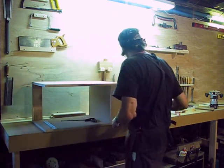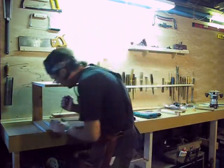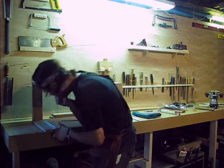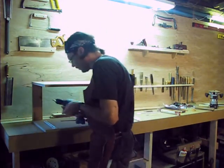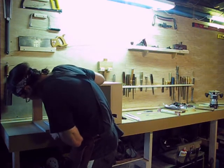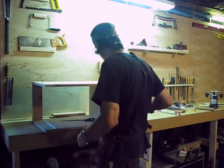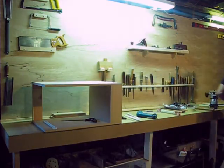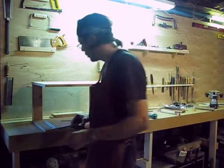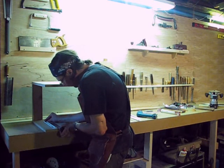Yep, looks pretty good. They come with these tiny little screws. You want to start them with your awl, just so they line up right. Okay. Careful not to strip them. Okay. And then I don't want to reset my combo square, so I'll just grab one of my other squares and make sure, just by eye really. Yeah, it's pretty square.